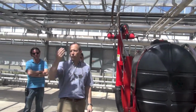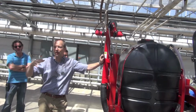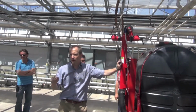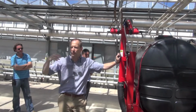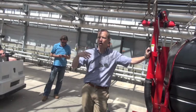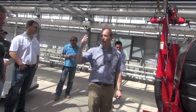So that one, they're just ripping down the center, just that one little tractor way, and that's how they're treated. You guys are going to be able to do it from the center, so it's going to take a little bit longer stops, but it'll take the same amount of time to fog. Maybe a little less, maybe a little more if we use a smaller nozzle. But we're going to want to watch based on distance. Start with the 7s, and maybe you can adjust up a little bit, depending on what we see at coverage in the middle or the ends. Also, the HAF ends will help with that, so I'm a little less worried. As long as we keep the HAF off during application and turn them on afterwards, that'll help distribute it. If we go to a higher flow rate, you guys are set up well for that.